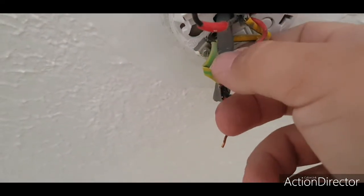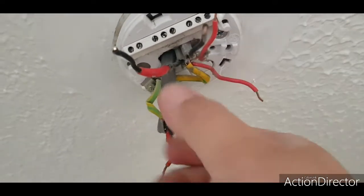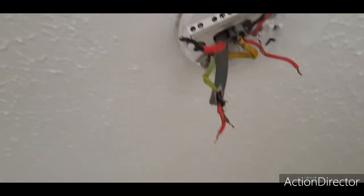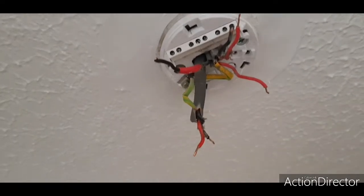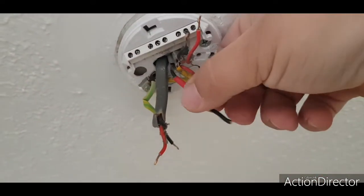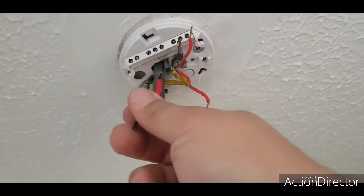That'll short out the two conductors, which would be this one and that one, and then you can just do a quick continuity test. Bit of a nightmare if you've got a few more lights. You'd have to just go and buzz them out.